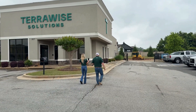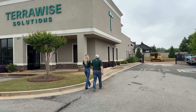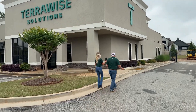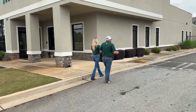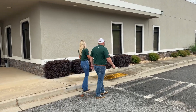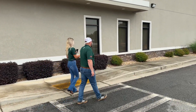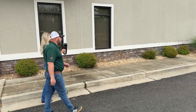Now we're going to head back to our starting point. Yes, we've already scanned this area, but as most people will tell you, you can't really have too many shots or too much location data. So we're going to come back and scan this area again, giving us really two scans of this area. That's going to densify our point cloud and make it pretty easy, once we move it to control, to pull out those feature lines and topo information for our client.